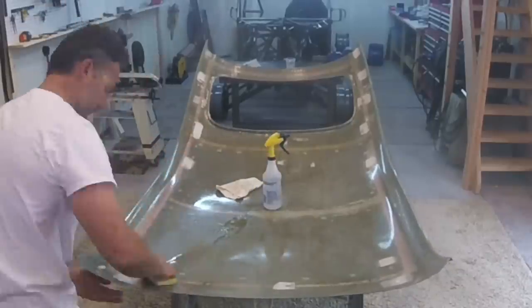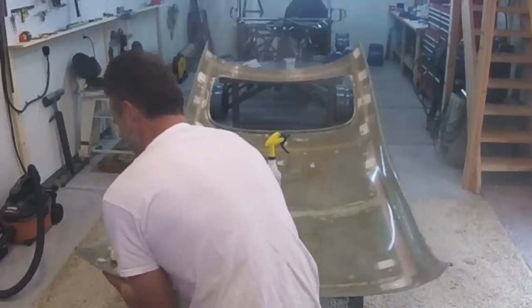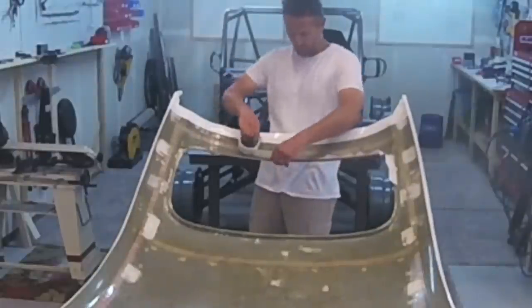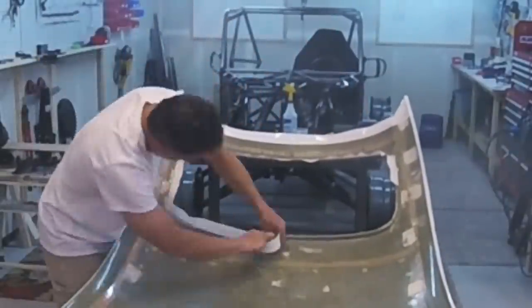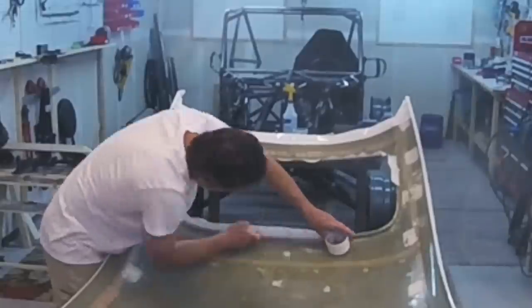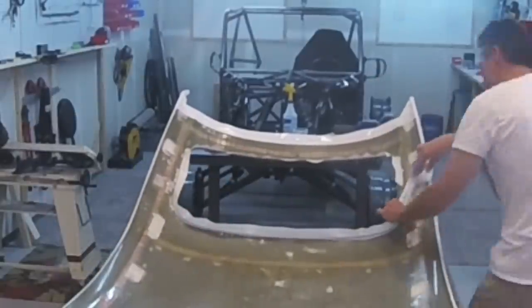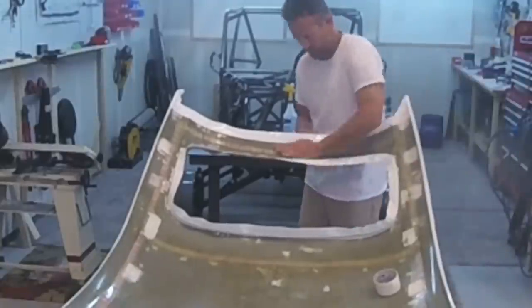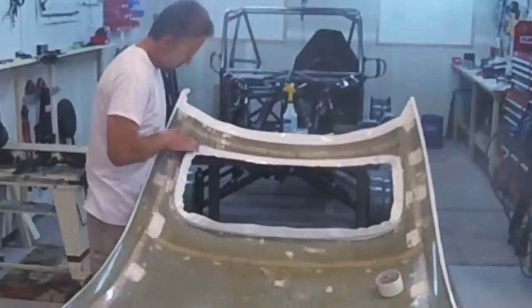I know it's not going to be perfect and I know I'm going to have to make some repairs to the gel coat, but I'm trying to get it as nice as I can. Here I'm using duct tape around the mold, pretty much exactly like I used duct tape around the edges of the body when making the mold. The duct tape is such a great releasing agent that anywhere I've got resin or gel coat coming up to the edges, it comes off real easy.